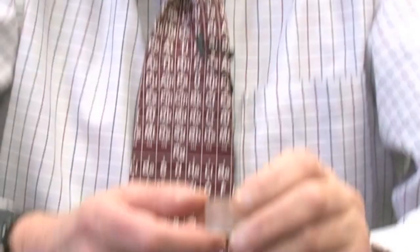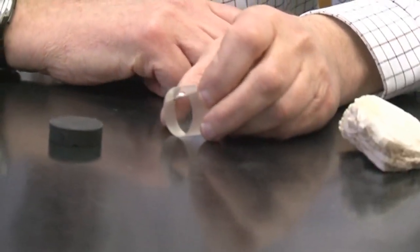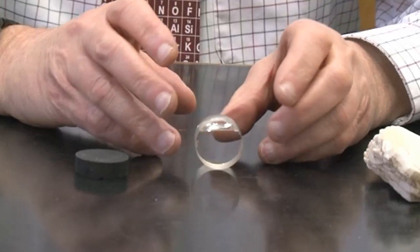Here's quite a large window — you can see my eye through it. This one, unfortunately, is cracked, so it's no use anymore. This is calcium fluoride. Calcium fluoride is much cheaper than barium fluoride, so if you can get away with it, you use calcium fluoride for an experiment. The problem is that calcium ions are quite light, and the fluoride and calcium ions vibrate in the crystal through thermal energy, and these vibrations absorb infrared light. Barium is much heavier, so barium fluoride vibrates more slowly and absorbs much longer wavelength light. So in a particular experiment, if you need to get that region of the spectrum, you have to go for barium fluoride instead.